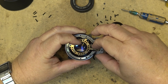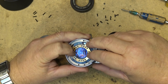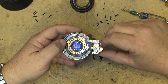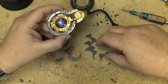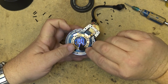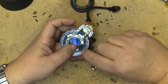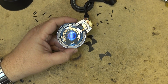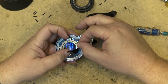So then the lens gets stuck open or stuck closed or stuck at some point. Normally when this is working, the iris control motor here moves this back and forth like that. And that's what opens and closes the blades, being these things. And these blades sit on this pivot like this. And the blades all sit the same way. You need patience to put these things together.